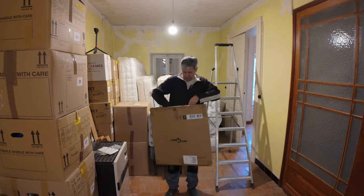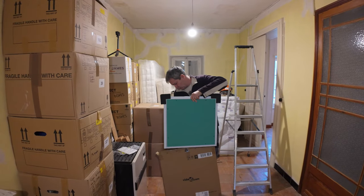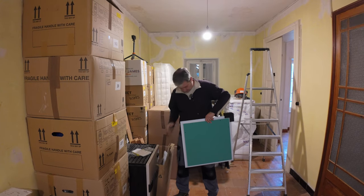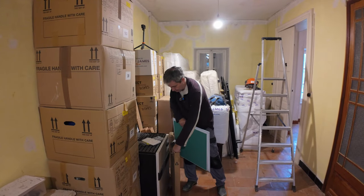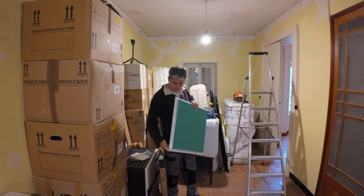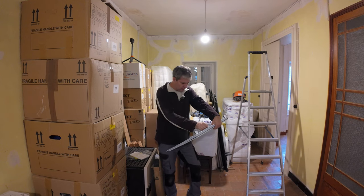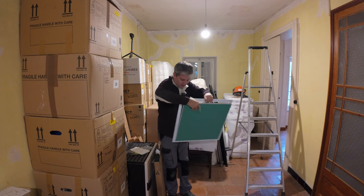So let's do that. What I want to do is install one of these guys here. Basically, it's like a half a meter trap door thing that pops out, which I've done one already. And we're just going to continue on, getting the other three installed. Hopefully they go a lot quicker now that I know what I'm doing. I'm just going to take the frame, because basically you cut the hole through the lath and plaster here, and the plaster comes and matches it. You make it flush and then it's under the lock, and then you can unpop it and it folds down like that.